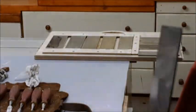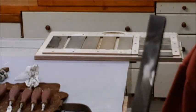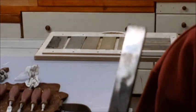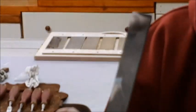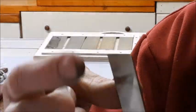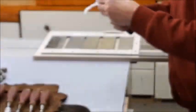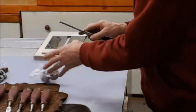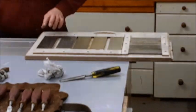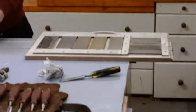There we go. Now at the tip that is nice and shiny. There's no dips. You don't have to remove a finish — you just want to make sure you've got no dips or holes or places that aren't getting touched, and that it's getting touched everywhere. Now you'll get a good tip on that. You don't have to do that every time — you do this once when you first get it, and as long as you don't damage the chisel, you'll never have to do that again. All you have to do is take the burr off as you're sharpening.